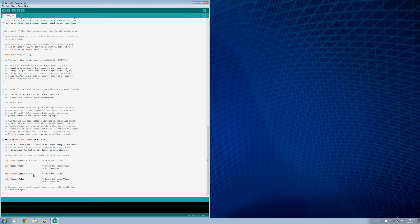Then it turns the light off and delays again for the same amount of time. So if the potentiometer gives a high value, the LED stays on for a long time, then off for a long time — slow flashing. When you turn it to a low value, it flashes very fast. Right now we're working with only digital, so it's just high or low with no in-between, but fast flashing can simulate brightness.